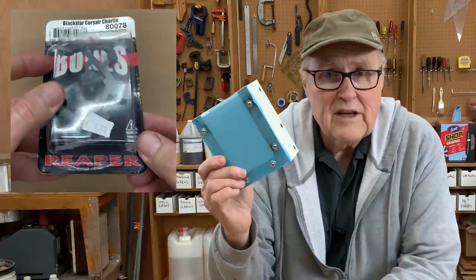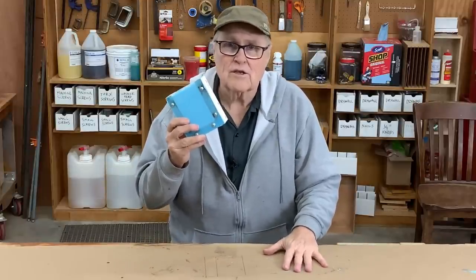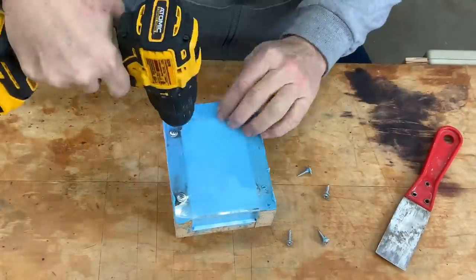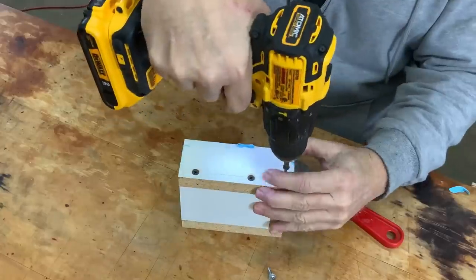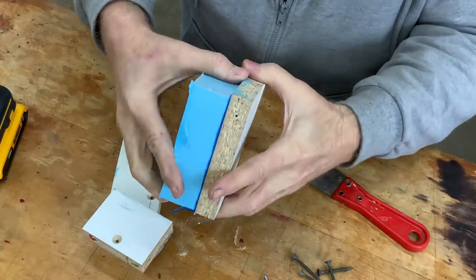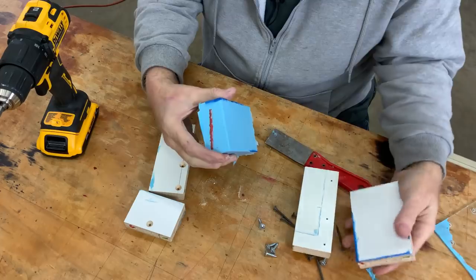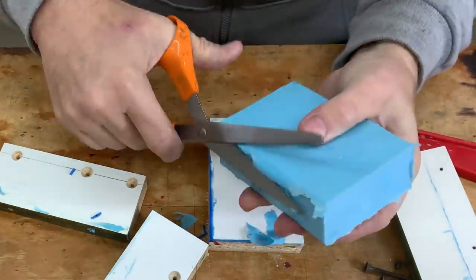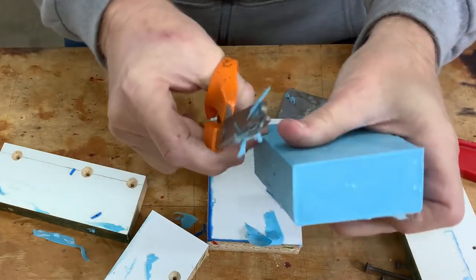Last week we made this mold out of this kit. I don't like cutting molds with paper on my bench because it just slips and slides all over the place, so let's just pull it off. That's why I love wax — absolutely no leakage, none. I always like to clean the flash off of molds with scissors; I think that's the easiest and best way to do it. This serves no function, it just makes the mold a little prettier and more craftly.